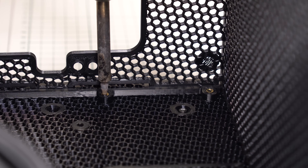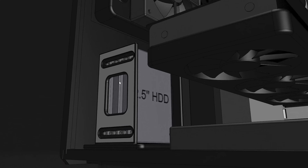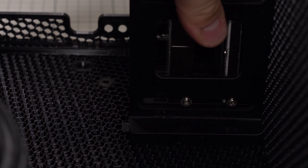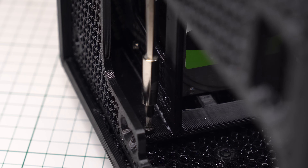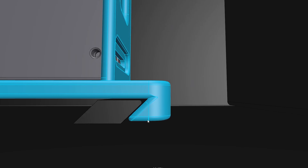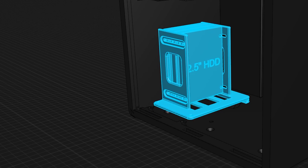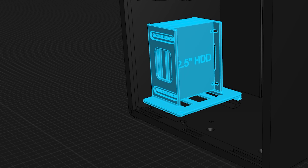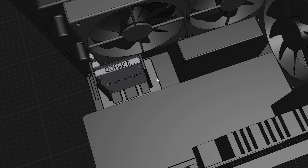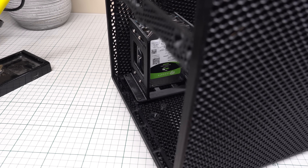This is optional and only meant if you really need a lot of hard drives, but it's nice to have the option as the space would otherwise be empty. The mounting bracket has a 45-degree edge that hooks onto the other 45-degree edge on the mounting point, and is then secured using two M3 by 10mm screws. I chose this 45-degree hook mount so the hard drive bracket could easily be added or removed with front access at a later stage, without struggling with small screw mounts in the middle of the chassis when the case is full of parts and cables.